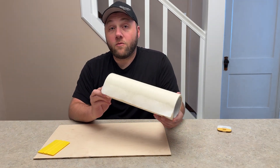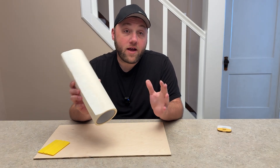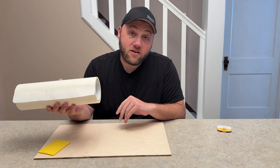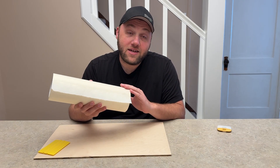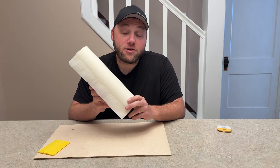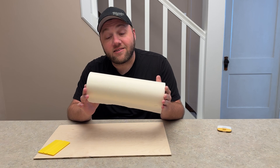This masking tape does not work well with diode lasers because diode is a different wavelength. Lighter material just seems to bounce off - it's harder to work with. It will work with a diode laser, but in my opinion I haven't had good experience with that. But for CO2 lasers, for the past six years I've been using this flawlessly.